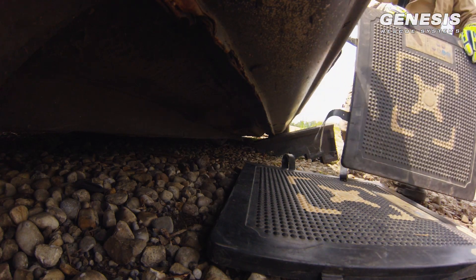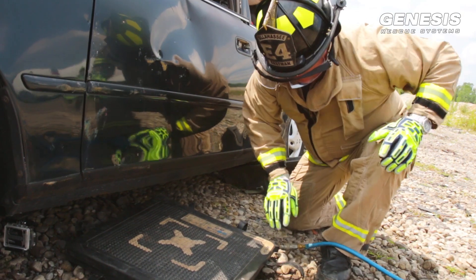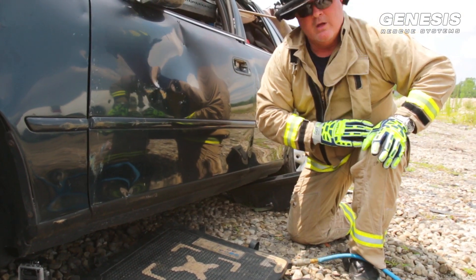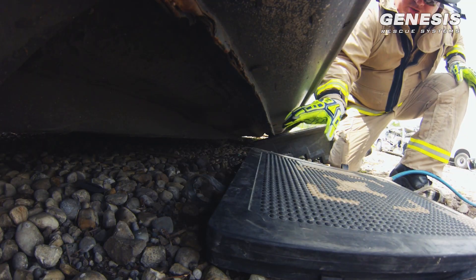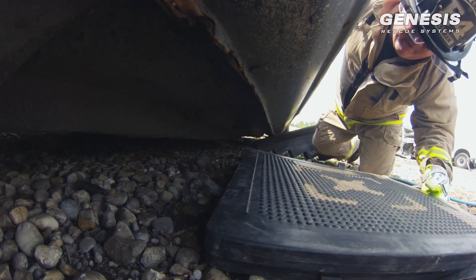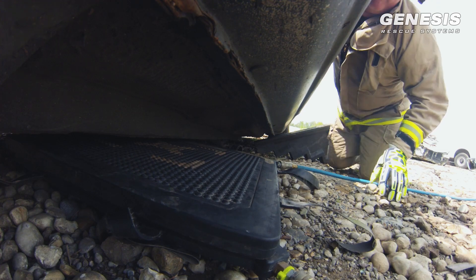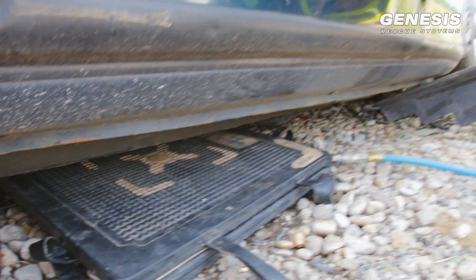We'll place our bags two bags together on top of each other. Remember that we want to keep our air hoses separate so we can be able to tell which side when we're lifting — if we're up on red or up on blue. Whatever area we're going to be lifting, we're going to make its dead center of the X. So when we slide it up under there, we want to look for the frame. If we fail to get it under the frame and it's either to the front or the back, it's going to want to have an effect of kicking out.